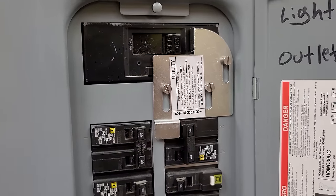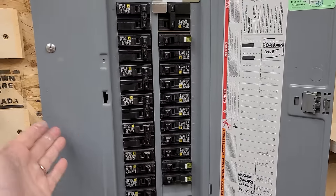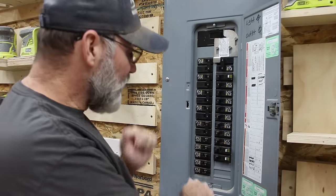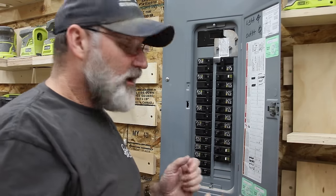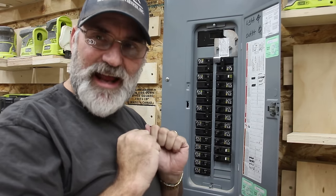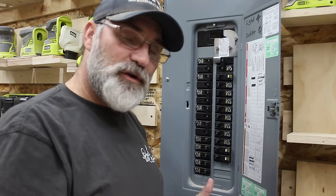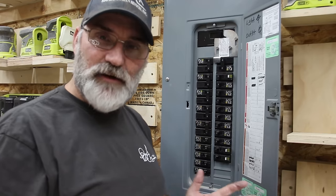In the case of a power outage, I would come out here and turn all the breakers to the off position — it wouldn't matter because there's no power, so everything is kind of off anyway. Then I'm going to switch the mains to generator, so the generator is going to be generating electricity and it's going to be plugged into the house. Then I'm slowly going to turn the load on one circuit at a time until the house is back on. You don't want to leave everything on and just switch over, because the generator — if I threw all the draw from the entire house on it — would go into an overload condition and probably just shut down.